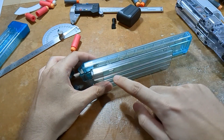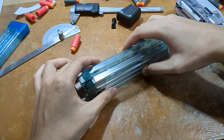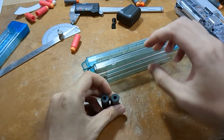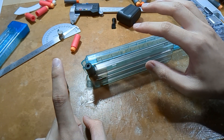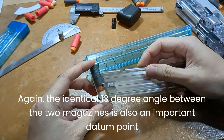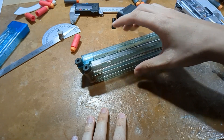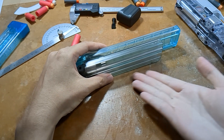Since there is a height difference between the two magazines, and the measurement is between here, we want to have the darts used as reference. It's a little difficult to explain, but I'll explain it along the way. Since the dart is the datum, we want to have the darts on the same plane as the magazine's bottom.